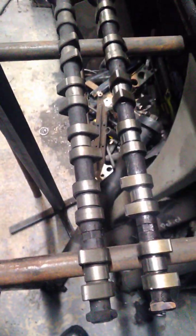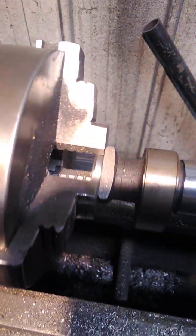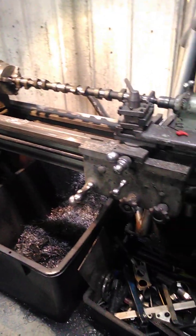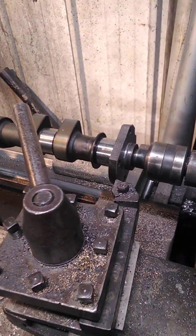But before I do that, I trim this end — from this end, which can't be grabbed. Being the fact that this is the timing tool end, once you put the NV M50 cam onto the exhaust side in a single Vanos engine, you can't use this timing lock anyway. So I still leave a little on there, because some guys have made timing locks that match them — some offset ones. But I take enough off to grab it in the lathe. A little bit of 1910 technology that I'm using to transform late model cars. It works extremely well. I've done it this way five or six times now.